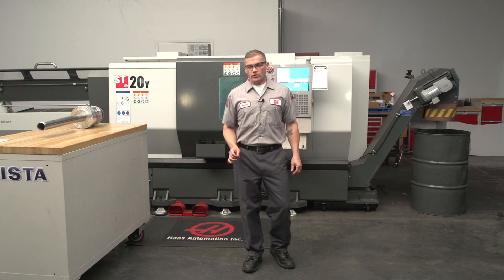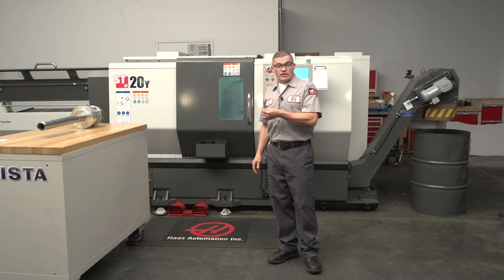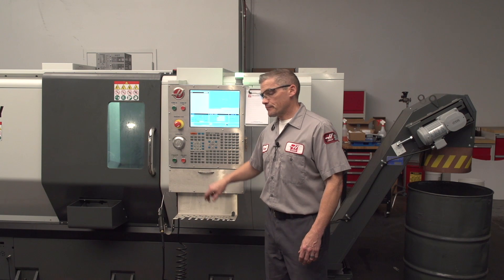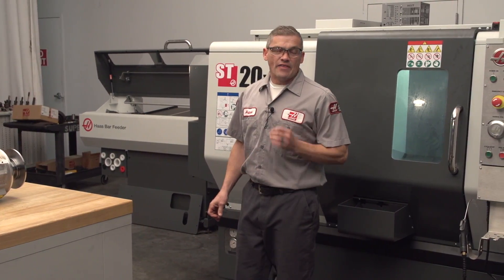Now to demonstrate just how important the correct oil level is, we've removed nearly half the oil on the older style tank here on our ST20. We've reached the threshold where at 3,400 RPM and 300 PSI chuck pressure the HPU is getting noisy and we're seeing fluctuations at the pressure gauge. We can even see that the oil is indeed aerated as it flows back through the union return line. If we reduce our running speed down below 2,000 RPM, our problem seems to go away. Or if we reduce chuck pressure down to 200 PSI, the noise subsides and the oil gets clear again.